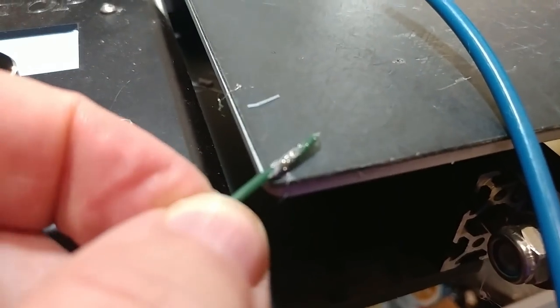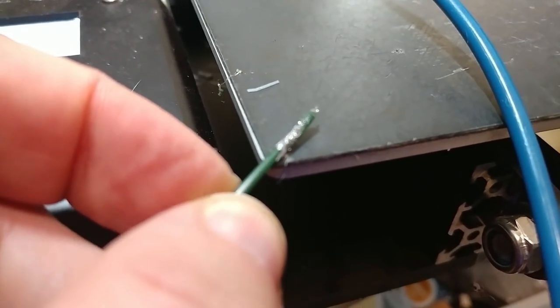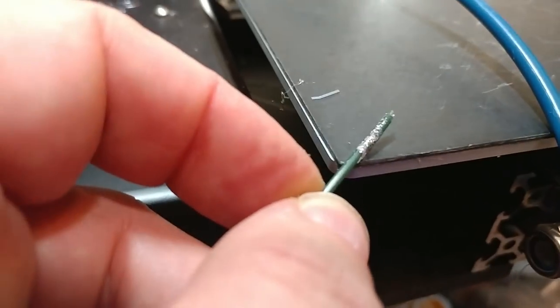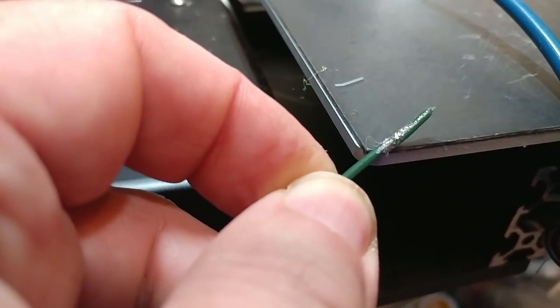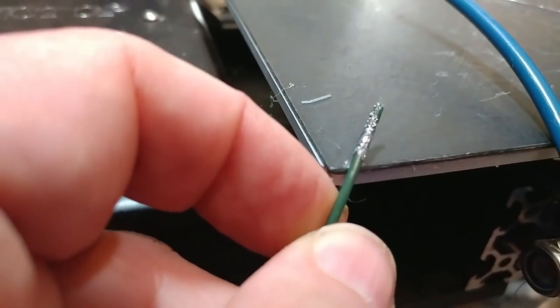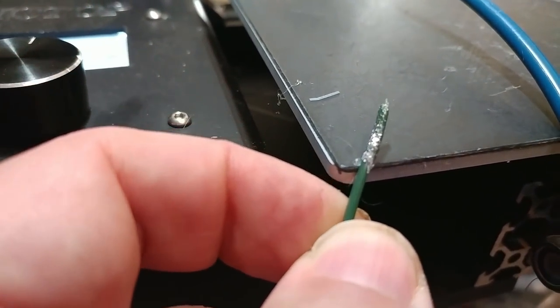See the culprit? Looks like the glitter stuff caked up in there. So I might want to increase the temperature I run the glitter stuff at, just to make sure it flows a little better. That's all glitter stuff from the twinkling filament.